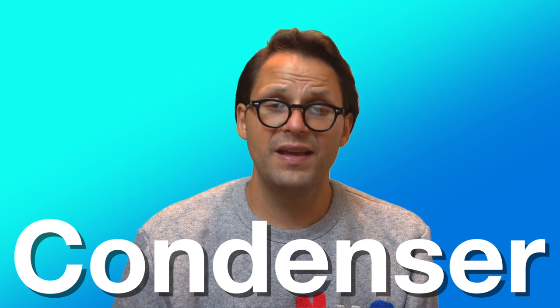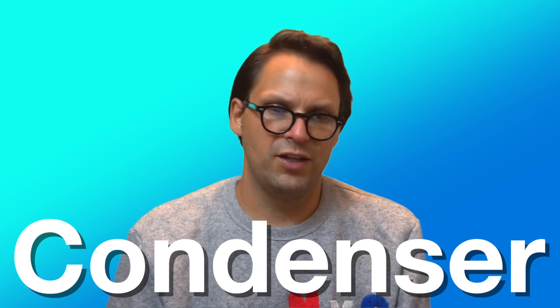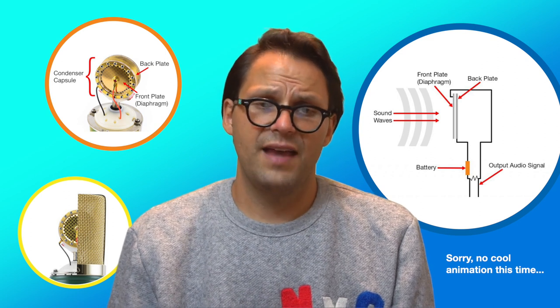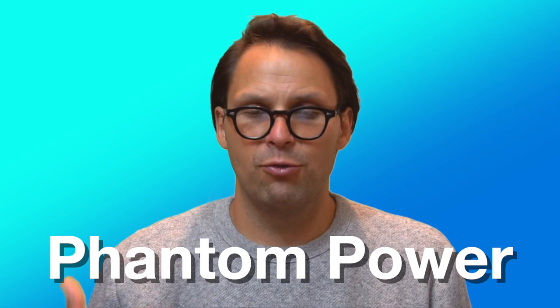The other kind of common microphone are condenser microphones. Condenser microphones, which come in two basic configurations — large and small diaphragm — can also be used in live settings, though are a bit less common than dynamic microphones, particularly for rehearsals or smaller venues. Condenser mics have a thin conductive diaphragm that sits close to a metal backplate. This configuration works like a capacitor, wherein sound pressure vibrates the diaphragm, which in turn changes the capacitance to produce the audio signal. This delicate mechanism improves fidelity, making these mics ideal for recording in the studio, but also more susceptible to damage. It's important to note that these microphones also require power to function, so you'll need a mixer or direct box with phantom power, which is DC electric power transmitted through microphone cables.